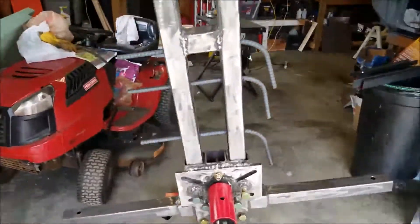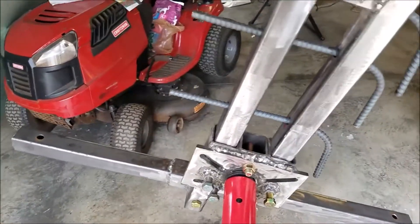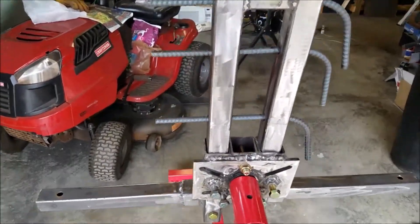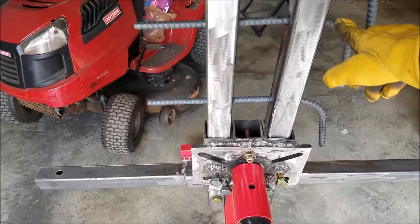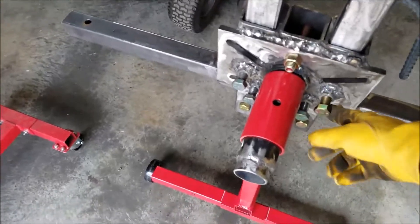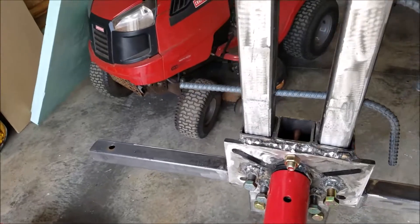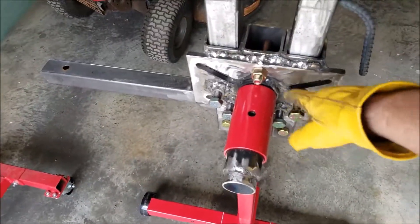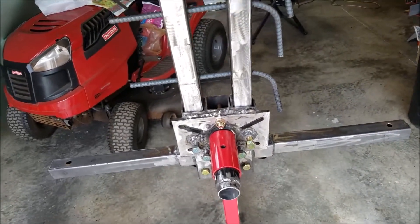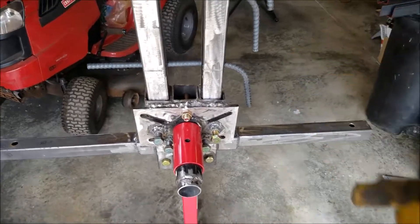Here's another update — I'm pretty sure I'm done with this thing. This is the apparatus for the front of the rotisserie. These rebars are actually brakes. So if the rotisserie is at this position and held in by these bolts — just tightening all four — these will act as brakes. If for some reason they fail, this will stop it. I know it'll wreck and bend, but it's safety and I don't want to be underneath the car when it falls.